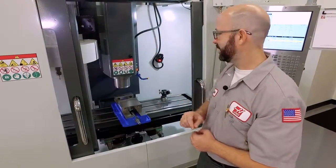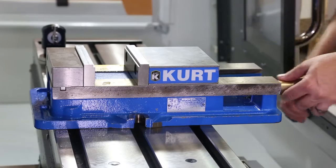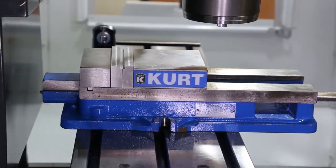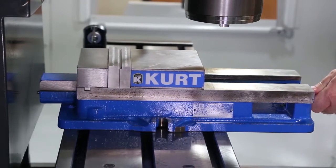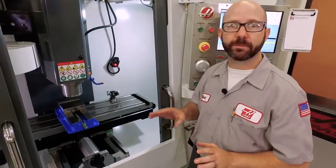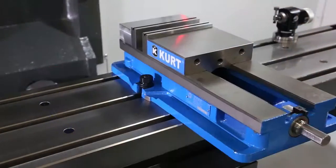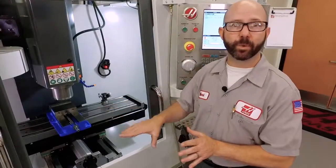We still have to check one more thing — the vise is open right now. Let's close it and see how we do. Everything looks great still. But when we jog our Y-axis back, the nut is sticking out the back of the vise by about an inch and a half — and we only had a quarter inch of clearance before. The back of the vise, when closed, is now going to go straight through our Z-axis way cover if we jog this axis all the way back. It looks like there's no safe position to mount this particular style of vise on this size machine. If you need a vise for your TM1P, check out the different brands, look at the specs, and make sure you find one that fits — that's likely going to be a D688 vise. But even with that vise, you still have to make sure it's mounted in a way where it won't hit the doors or your way covers.